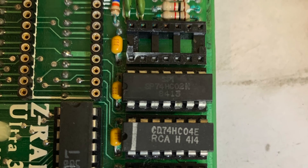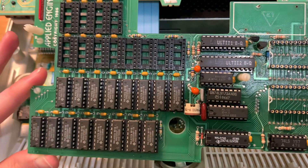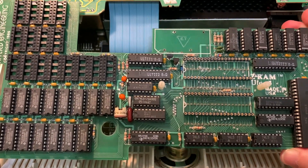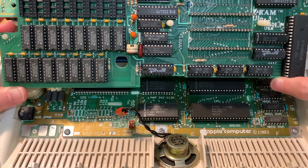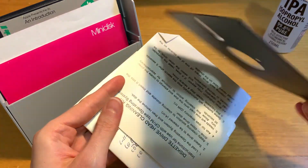I unsocketed a few chips as well — like this one I had to soak the pins in vinegar — and gave the expansion board a general cleanup. But then I thought, wouldn't it be bad if the Apple IIc actually doesn't work, so I went and put the CPU and the MMU back into their sockets to give it a go with some proper software.